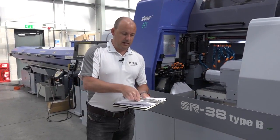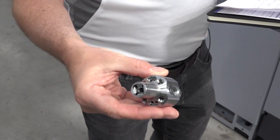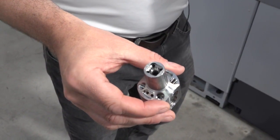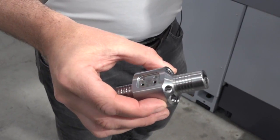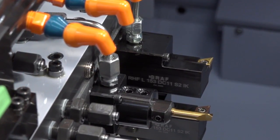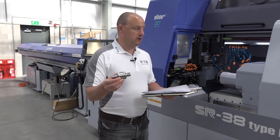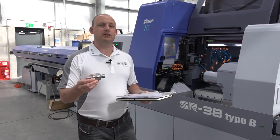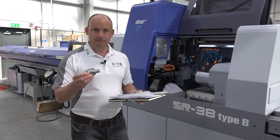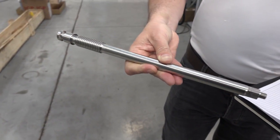For shorter parts, looking at this component, the combination of lots of tools, the B-axis, and driven tools on the back end means you can machine more complex parts. Here's an example of a part that has used the B-axis to do angled holes on back faces. You can see features that have been turned, milled, and drilled — all done in one cycle on this machine. Without a machine of this complexity you could be talking about two or three different machines, introducing inaccuracies and significantly increasing cycle time. This machine is about reducing cycle times on complex parts and turning longer components.